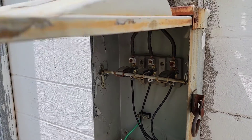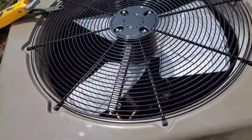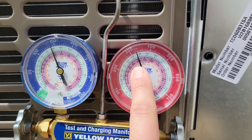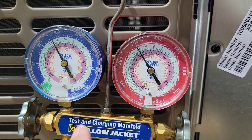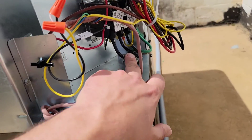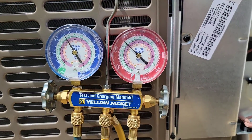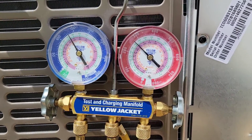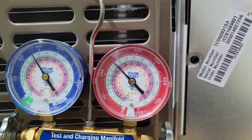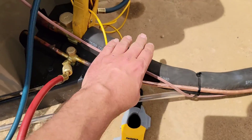Let's go ahead and close the box first — somewhat safe safety. Turn the unit on. It just came on. Suction should pull down. Head pressure should be around 300; suction pressure should be about 120. And if it's running backwards, it's going to make a very, very loud noise — I'm going to have to switch two of those legs. It looks like it's not running backwards; it looks like we're actually properly phased here. Suction is 125, 130. Head pressure is 275.